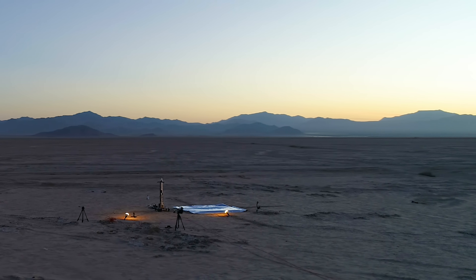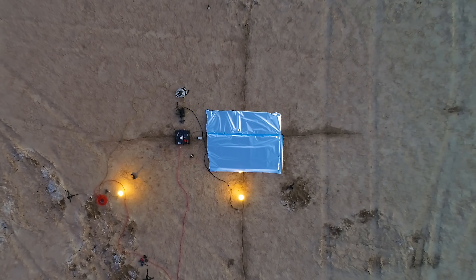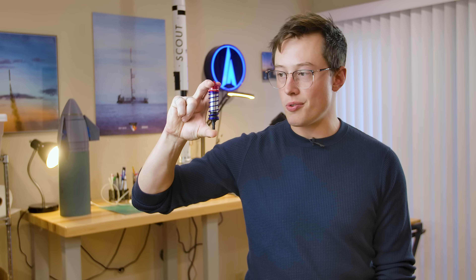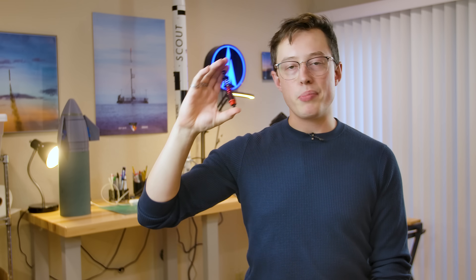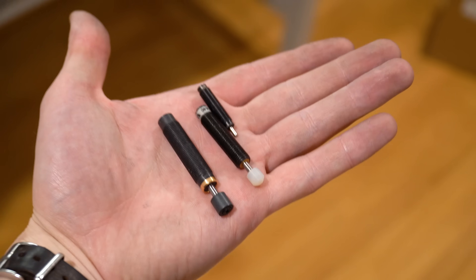In the transition between flights three and four, I removed the landing pad that the rocket was supposed to touch down on. The original goal was to use the pad for shock absorption so that the legs didn't bounce so much. The design we have on the vehicle is extremely lightweight but it's pretty bouncy. In removing the landing pad, I needed to solve that problem, and one of the solutions on my mind was a linear damper. A pretty regular comment on this channel is that I should be using RC car shock absorbers on the landing legs to deaden the impact. These absorbers work great for little remote control cars — they're very springy and damp out motion quite well — but because they're springy, they spring back, and that's not what we want with these legs. In contrast, a linear damper dampens the motion but isn't focused on springing back. The goal is to just slow the velocity of that motion. A lot of the linear dampers I found have a much shorter travel range, which works well for the leg design we have here.